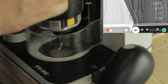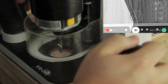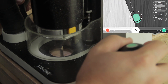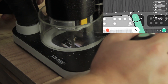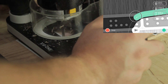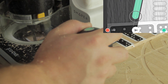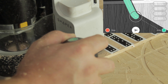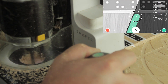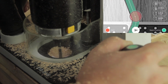So I'm going to go ahead and cut this out. We're going to do this first pass around — it's an offset of 1/16th of an inch outside of the line. I'm just going to go around quickly and get the large amount of work done where the bit is all the way engaged in the material. You can see that goes pretty quickly around. That's complete.